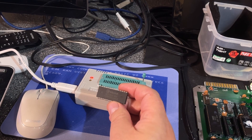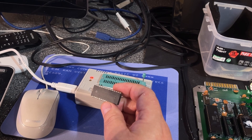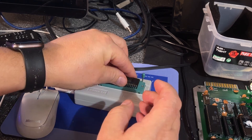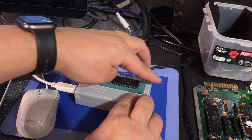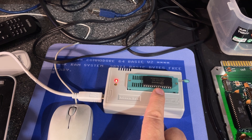This time I'm going to use a WinBond 27C512 — these are erasable EPROMs that you can use several times. The 512 EPROM means it's 512 kilobits, not bytes. So divide by 8 and you have a 64 kilobyte EPROM, and the bin file I downloaded is exactly 64 kilobytes.